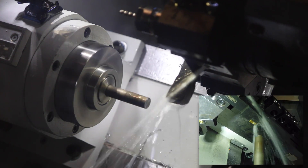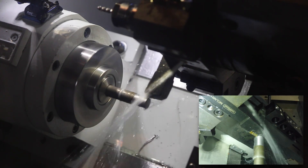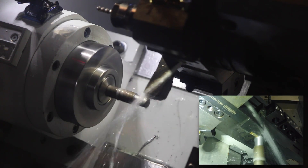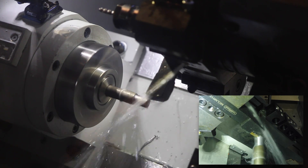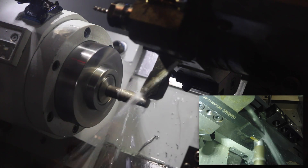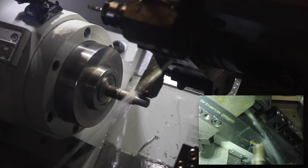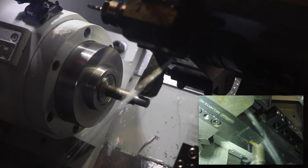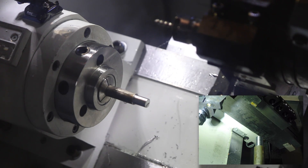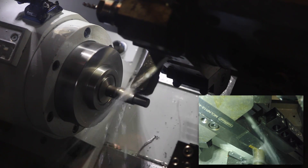Turning down the first section to 0.500. Pretty cool little chip — I don't even think there are chip breakers ground into this, but it's really cool. It is good to avoid those long stringy things and bird's nests. This is a 5 thou cleanup pass. One of the things I've tried to focus on is setting the correct tool length, and that's what really gives you your precision. Hopefully when we take this part off, we'll be within a thou or so. The machine's capable of it — it's just a question of correct tool height setup.